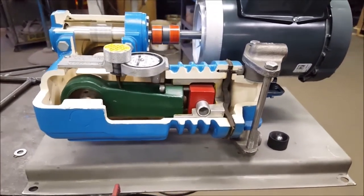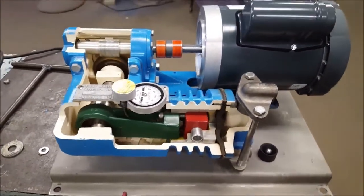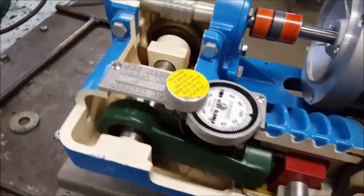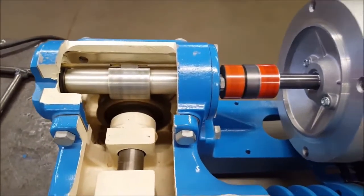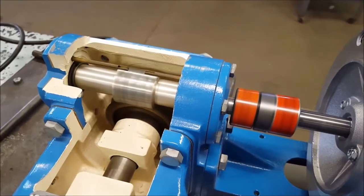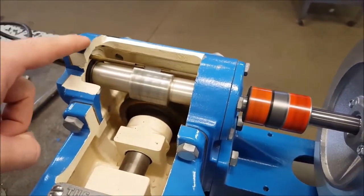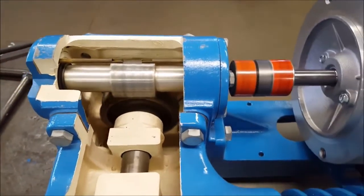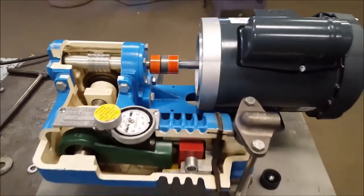Another feature of our pumps is the oil bath. Barring extreme temperatures or altitudes, we commonly suggest ISO 460 grade lubricating oil. When in operation, this pump will be submerged in this oil. The thick oil travels around the pump naturally, riding along the moving parts. It is also able to make its way up the sprocket and onto the worm gear, which then runs over these oil feed tubes to travel into the bearings, thus truly allowing the pump to be completely and continuously submerged in oil, dramatically increasing the life of Madden pumps.